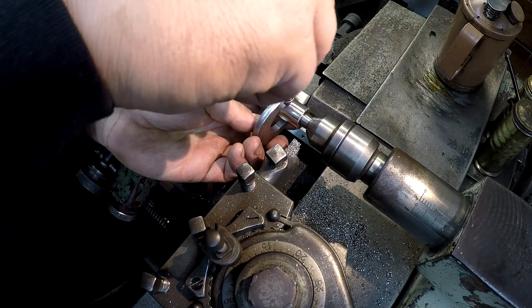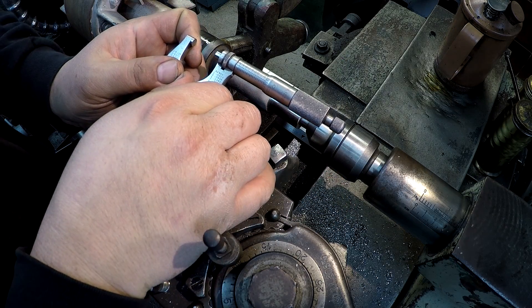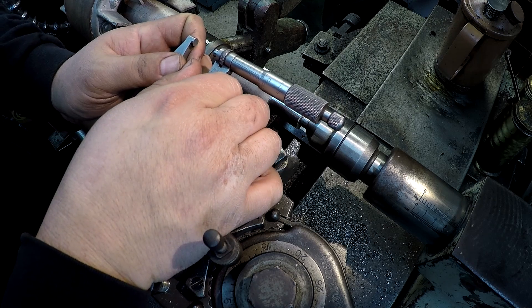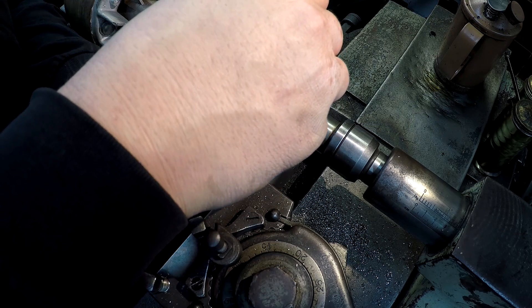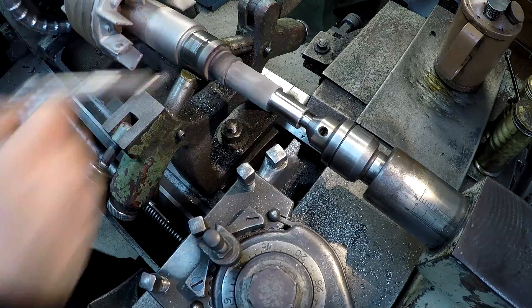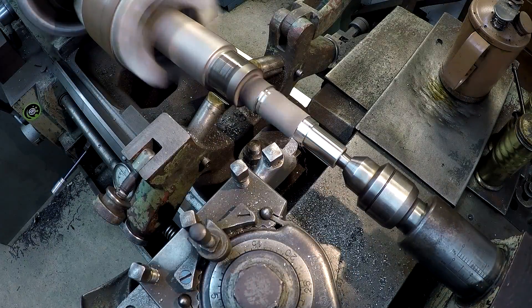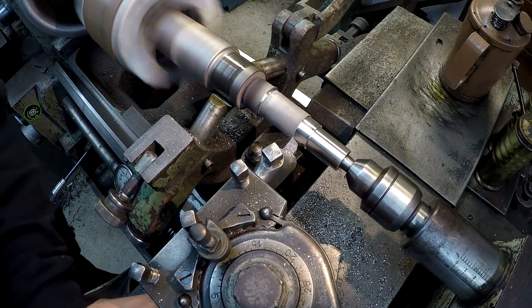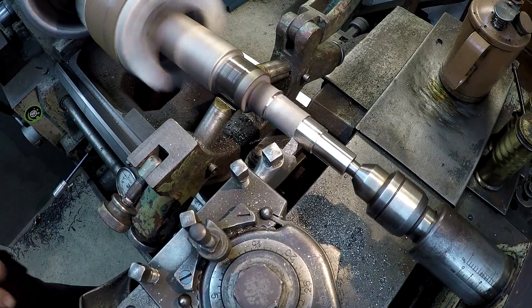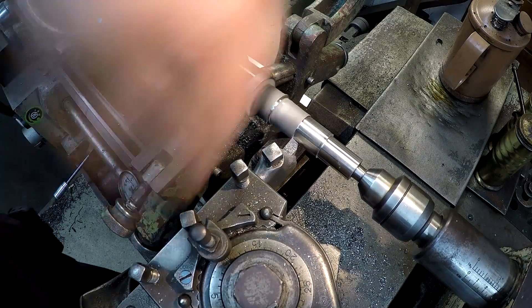I just made my finished cut here on the impeller end. I'm right on it — about a half a thousandths over, which is good. That leaves me enough, and right there is right on at 875. So all I got to do is just buff this a little bit and that'll be good. We're going to have to chamfer the end, but I'm going to go ahead and finish this end and move on down here and get going on this one. That's my first roughing cut here and that's leaving me with about 25 to 30 thousandths to clean up. I went ahead and came down here first and made sure I was on my shoulder properly — we'll have to do a little cleanup right here too.